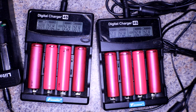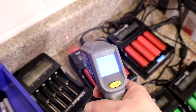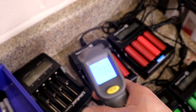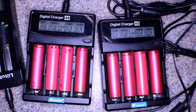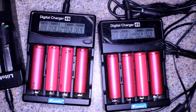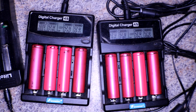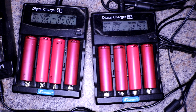I'll get my digital thermometer and see how hot it is. The countertop reads 73.5°F as a baseline. This cell is 133.5°F max temperature — that's 56°C. So that cell said 2103 and we're at 56°C. Next one is 2112 and came to 2134. Next is 2149 and came to 2152. Next is 2288 and came to 2217. Next is 2195 and came to 1935. Next looks like 2317 and came out with 2185. Next is 2363 and we're at 2241.